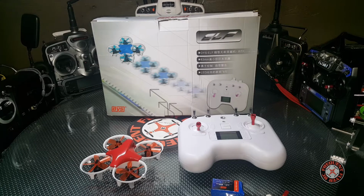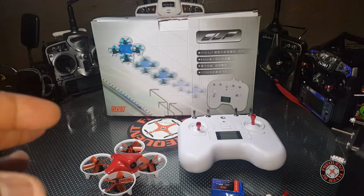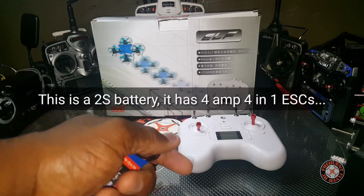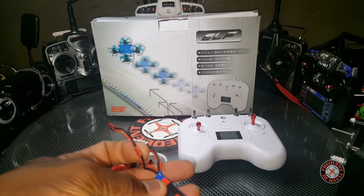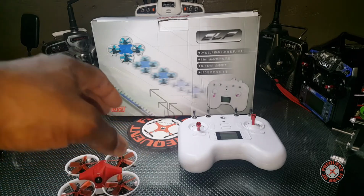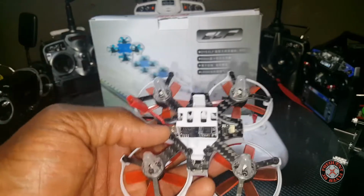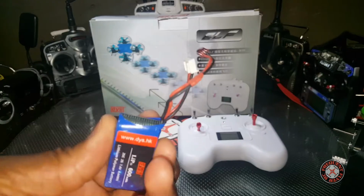Oh, and this thing has two major flaws, I think. Well, one might be just a little pet peeve of mine. That was the power connector on it, and the power lead on the battery. It's a proprietary connection. Man, I don't even have it anymore. I was so annoyed by it that I immediately modded it. I apologized in the first video that I did with this thing, but I swapped it out for a JST connection. And I did the same thing for the battery.